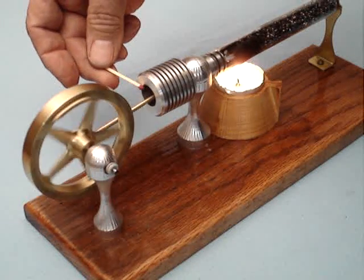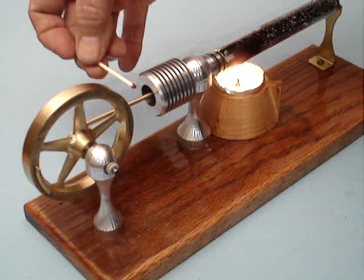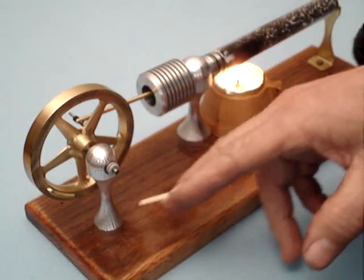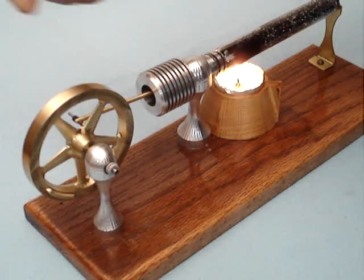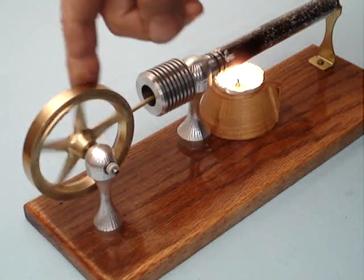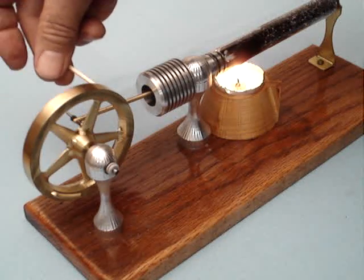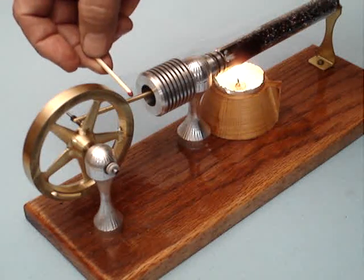The piston is made out of graphite EDM electrode, and the connecting rod is an eighth inch brass rod. I've CNC'd the flywheel out of three inch brass and CNC'd the flywheel support as well. I've used ball bearings on the main shaft, with a pin in one of the flywheel spokes for a connecting rod journal, and a drilled and reamed 1/16th inch hole in the brass rod for the connecting rod.